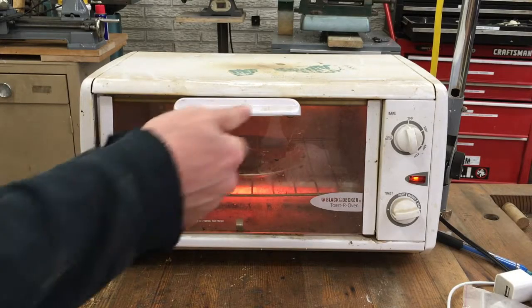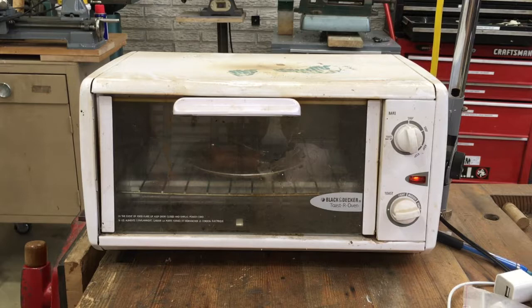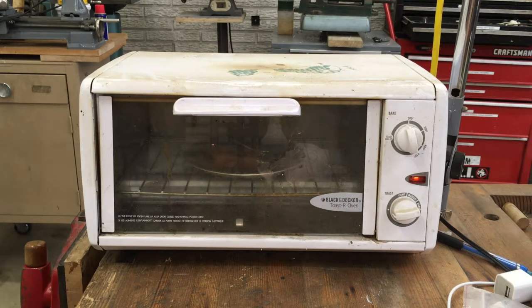It's really getting warm in there now. Not much has happened with the capacitor yet, but I can tell the wax is starting to melt because it's getting shiny. I've got it at about 200 degrees Fahrenheit. I can see it's starting to drip. Many old electronics have electrolytic capacitors made out of foil rolled up and stuffed inside a tube and sealed with beeswax. The insulator dries out over time and that drops the capacitance. This one was rated at 30 and 75 microfarads and I tested them — they were down to just picofarads, barely anything.